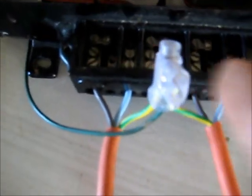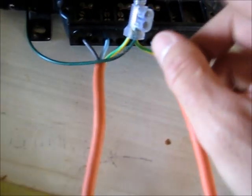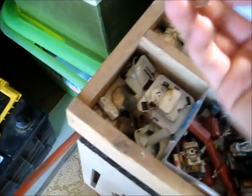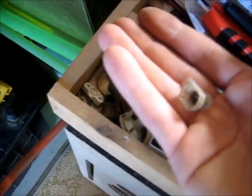I've got the reels, I've got the wiring all done, the earth's on. There's a proper Australian standard screw terminal — this is what we use in Australia instead of those wire nuts that they use in America. These are a lot safer. This particular one uses two screws, and these two-screw ones I use for earthing only. These single ones are for your active and your neutral — you put a couple of wires in there, screw them in nice and tight, and just tape it up. They're much more safer than the wire nuts.